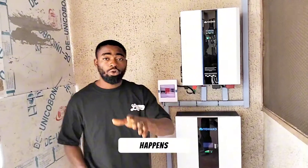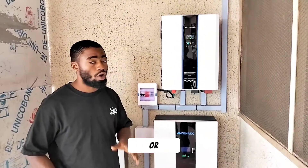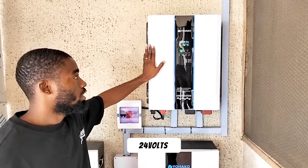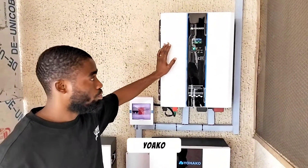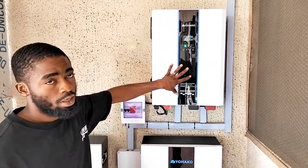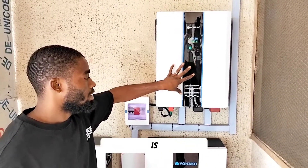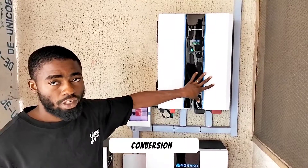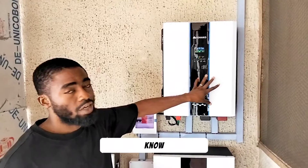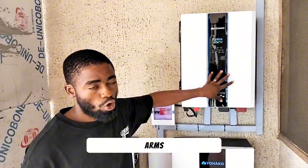You may need to upgrade your Bluetooth system so it can be accessed from your phone. Here we have a 5kVA 24-volt hybrid inverter — you can see it is the HAPO brand. This comes with a built-in charge controller of 100 amps. What I love about this inverter is that the built-in charge controller does energy conversion. We were expecting 60 to 70 amps from our solar panels, but at the end of the day we got around 90 to 100 amps coming to our battery.